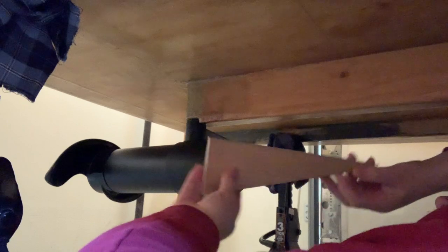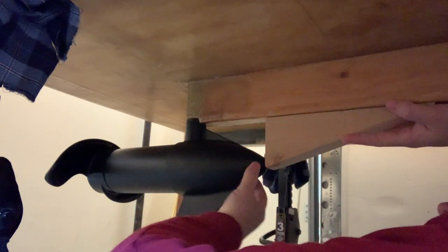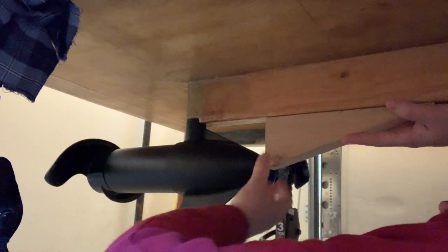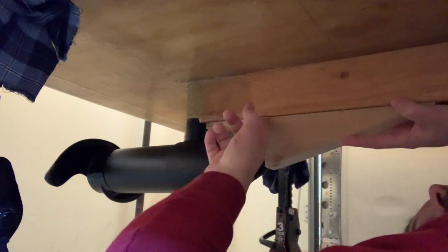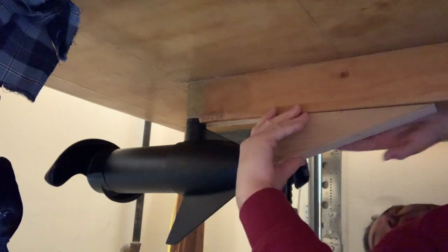What I'm going to do — I've got duct tape and the keel protector. I'm going to duct tape it to the keel and then drill a couple of holes so that I can coat the seam with resin, then screw it in place, let the resin cure, and then cover up the entire thing.